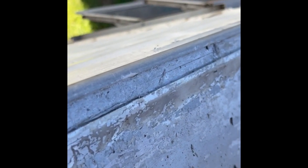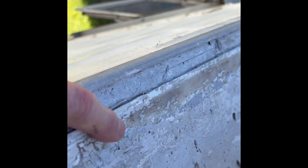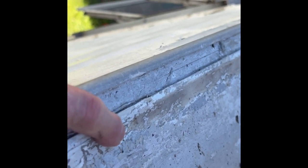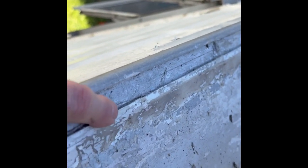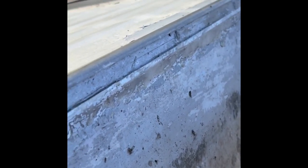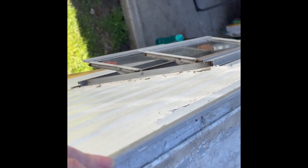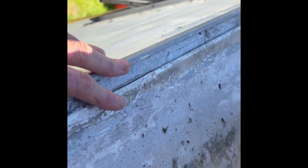While it could be quite sound, you don't know where the tiniest crack is. And I just feel I've got the tools. I think it's better to take all that back to bare and re-silicon it properly. Really don't want to take these J-rails off. I'm just going to silicon up to the edges, but clean it all up properly, and hopefully that works.